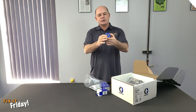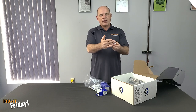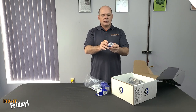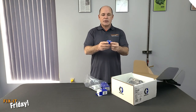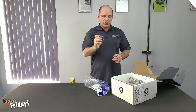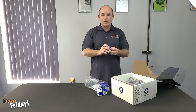There are some special features about the cartridge that we'll discuss as we go through this on how to line everything up properly. It's got a port for the A and the B side and the air, and that just has to go in the chamber just so. It's got some O-rings on it. These are not rebuildable — these are replaceable. So once they go bad, you put in a new one for a quick change out. There's not a rebuilding process when it comes to the internal parts like there is in other guns.